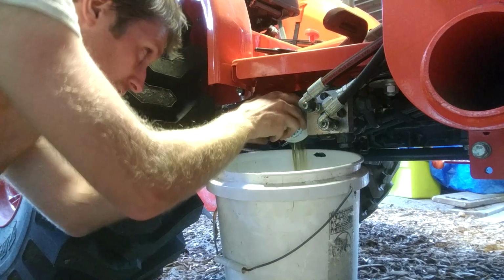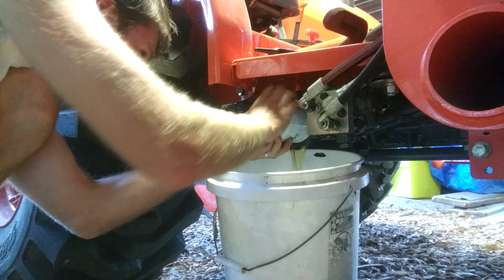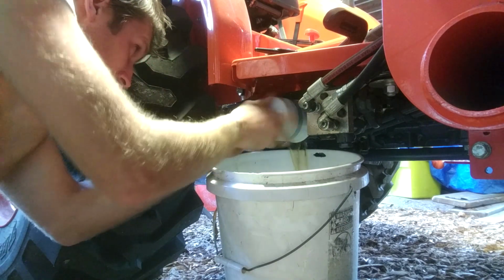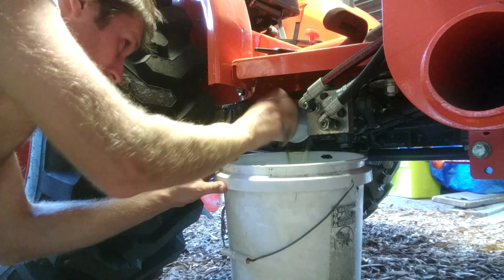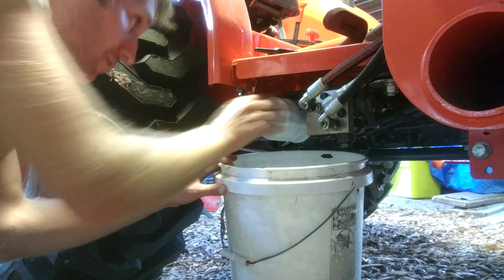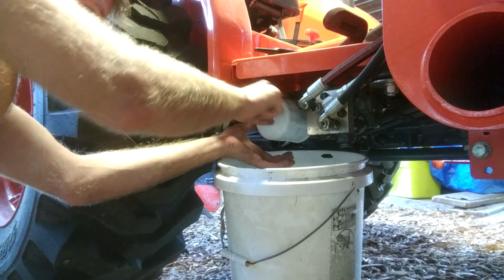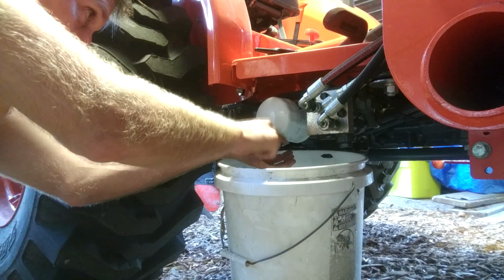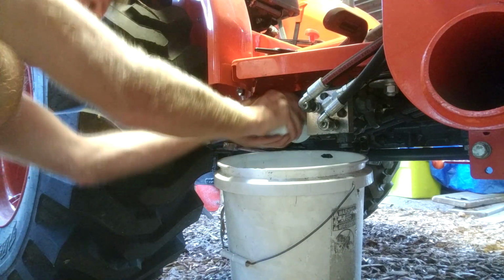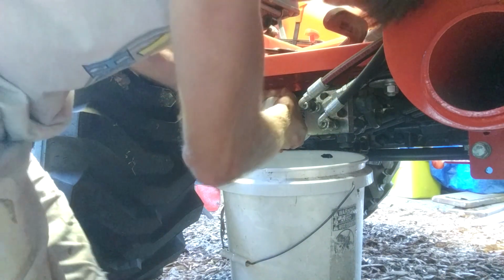Once the seal that you had put that hydraulic fluid on reaches and just touches the tractor, meaning that when it starts to slow down and get harder to turn, the instructions say to turn it 2/3 of a turn more. Check your filter to make sure it says the same, or if different, follow those instructions. An oil filter wrench can do this, but I find that I prefer to give my finger muscles a workout, so I simply turn it with my beautiful body. Turn it with your beautiful body too.